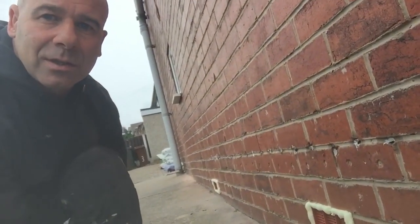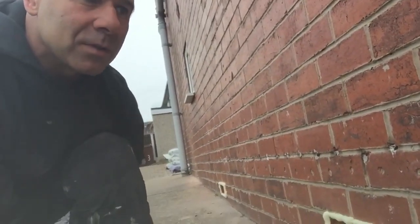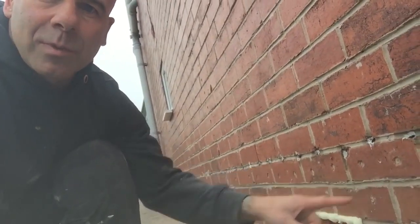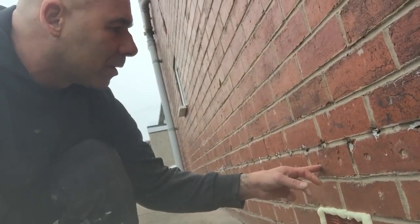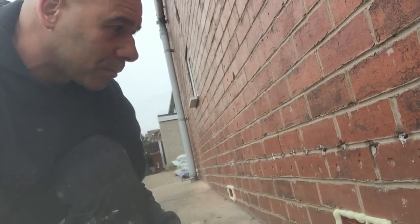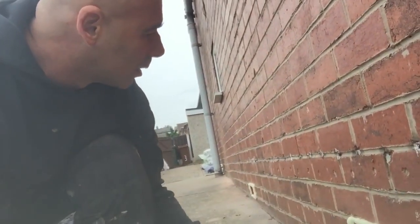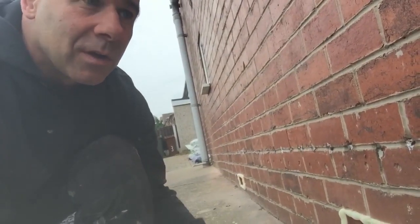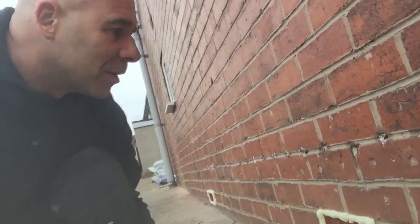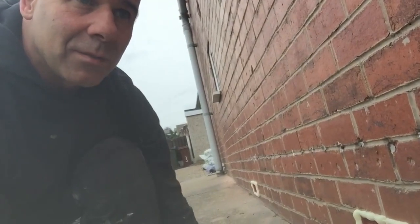That's basically why we're drilling and injecting into joints and not into brickwork. The other thing is, they've pointed these up here and they look a right mess. You can buy plugs that go in that are a terracotta colour - we'll point these up and it'll be the same colour as the brickwork, so you're not going to see a massive difference. But this is just a right mess and it probably won't be working.